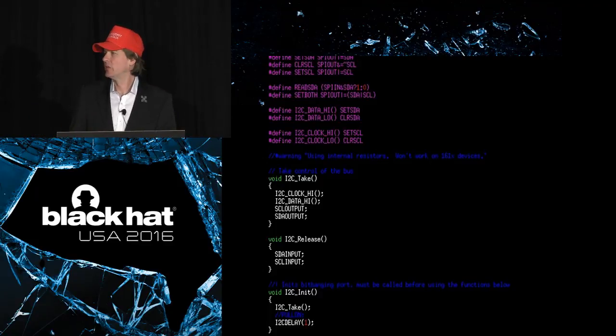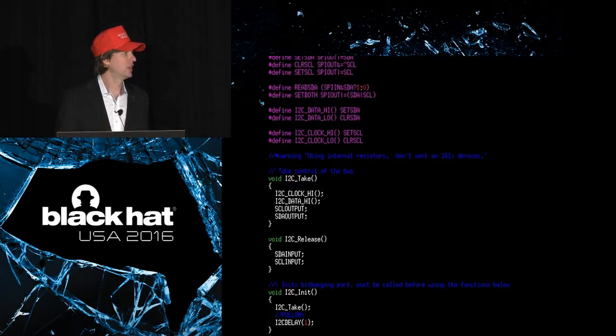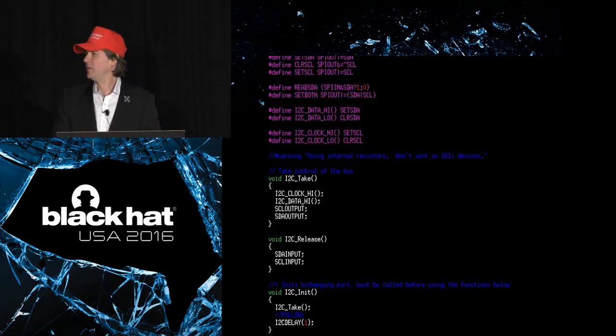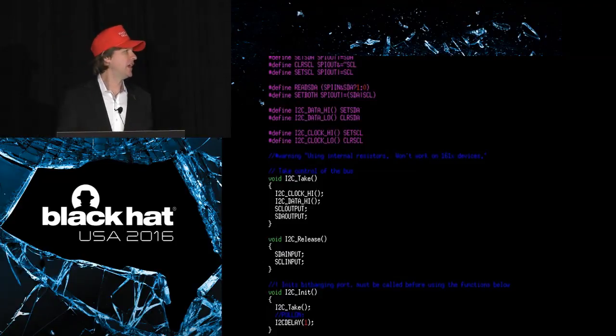But when you want to go back and maintain code or make it compatible with other targets, it's not necessarily the most flexible thing. If you want to change the speed that it's running at, say you have an interface that's running at 500 kilohertz and you want to run it at 2 megahertz or something, it may not be really obvious and easy to do that if it's bit bang code. And there are peripherals. There are little add-on components inside microcontrollers that do a lot of these kinds of functions for you. This particular one is an I2C interface from GoodFET. We're bit banging I2C with GoodFET, even though the chip has a special purpose I2C peripheral built in. We're just not using it. The I2C peripheral is higher performance and is relatively easy to use from a programming standpoint. And it would be nice if we could use some of those built-in peripherals.